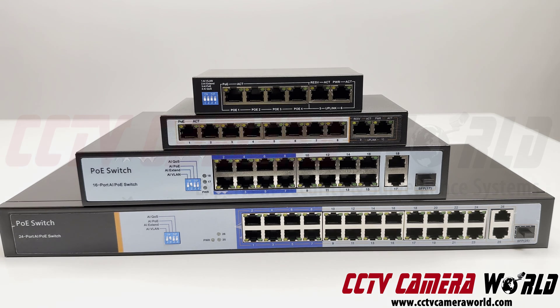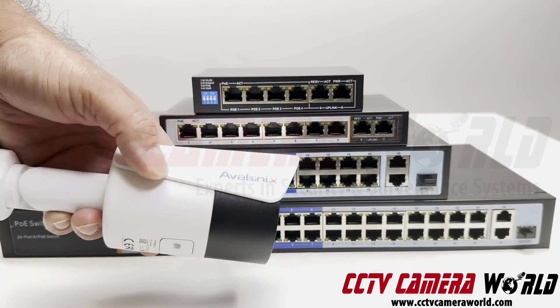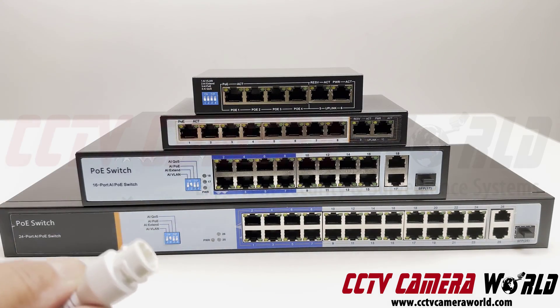The cameras that accommodate that sort of power are fixed-lens PoE cameras. You basically just use a Cat 5 jack, run a cable from here to the port on the PoE switch, and that's pretty much it — it lets you transmit up to 250 meters away.